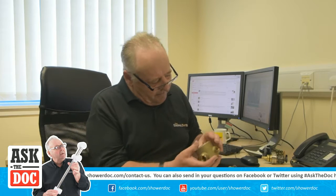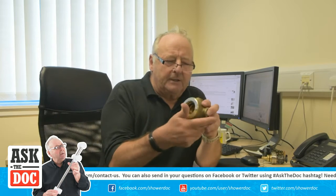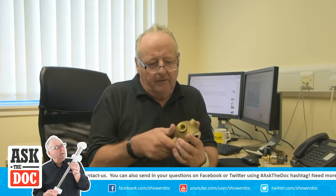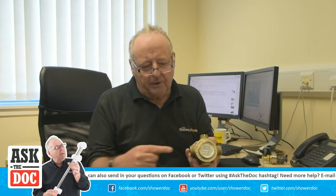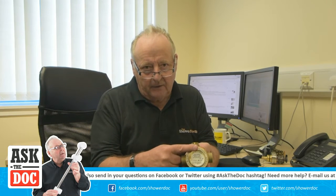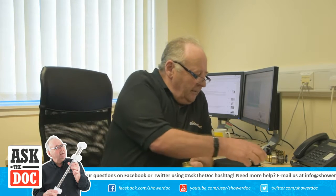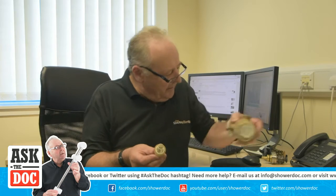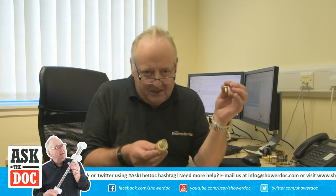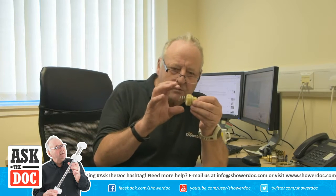Here's the inside of a shower — a fairly standard brass valve. This is the outlet, and these are the inlets. The water comes in here and runs to the back of the valve, and comes in this side and runs to the front. Between the back and front ports, the shuttle moves back and forward. As the thermostat senses the temperature, it moves the shuttle back and forward, and that's what controls the temperature.